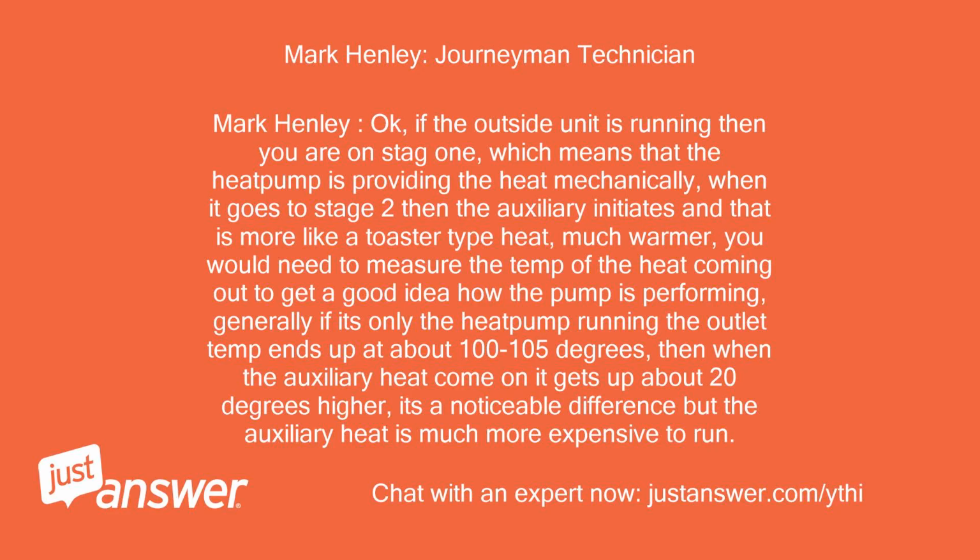Mark Henley, okay, if the outside unit is running then you are on stage 1, which means that the heat pump is providing the heat mechanically. When it goes to stage 2 then the auxiliary initiates, and that is more like a toaster type heat, much warmer. You would need to measure the temp of the heat coming out to get a good idea how the pump is performing. Generally if it's only the heat pump running, the outlet temp ends up at about 100 to 105 degrees, then when the auxiliary heat comes on it gets up about 20 degrees higher. It's a noticeable difference, but the auxiliary heat is much more expensive to run.